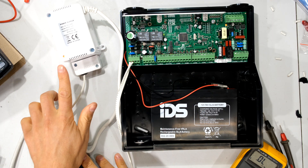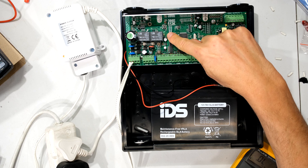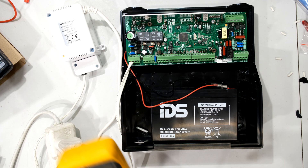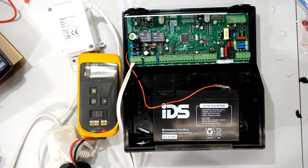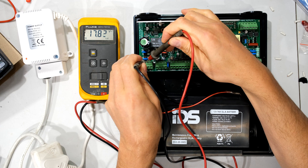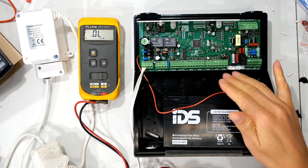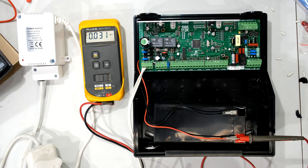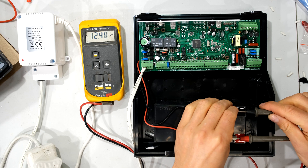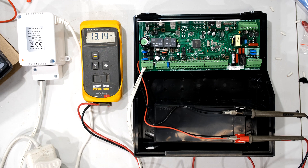You can see the red LED, I heard a relay click, and the alarm panel is now powered up — the green LED is flashing. Taking measurements: the input voltage from the transformer reads 17.8 volts, which is on the high side, but keep in mind nothing is really loaded here — no sensors or keypads and the battery is nearly full. At the battery terminal the reading is 13.12 volts and it's actually climbing.